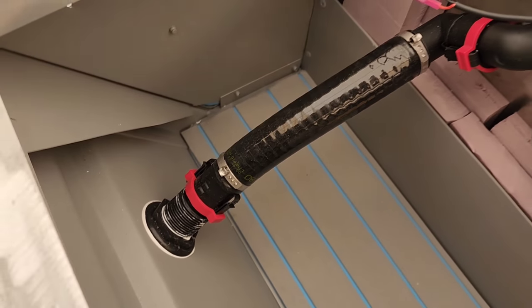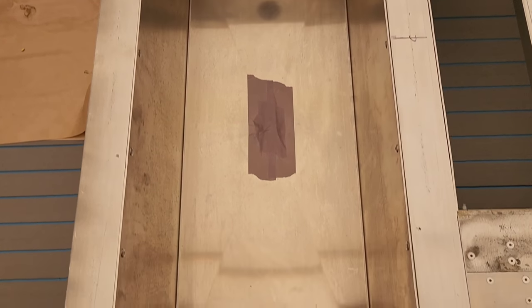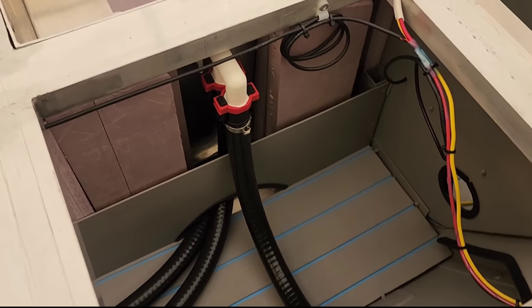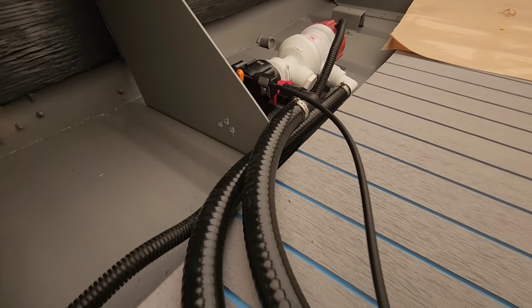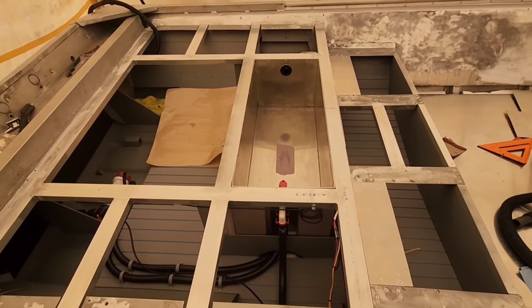I've got the larger diameter overflow running downhill on one side of the Livewell. The Livewell tank itself is mounted with a stamped bottom which runs downhill to the center drain. There's the Livewell pump out and fill combo on the other side, with the Livewell drain and fill hoses running in parallel together off to the sidewall, heading to the back of the boat, meeting up with the Livewell pump. All in all, really clean setup with plenty of storage, which is exactly what I was after.